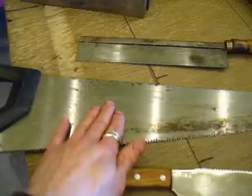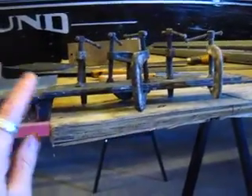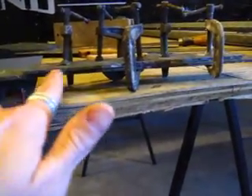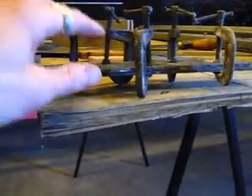These are probably good steels — you can do the hardenability test from the first video. For those who didn't understand: these blades will warp when you heat treat them because they're so thin, unless you get lucky. What you want to do is find two pieces of steel that are super straight and put your blade blank in between them and sandwich it.